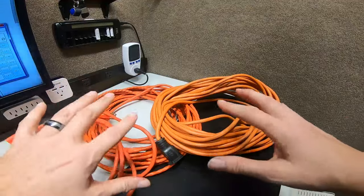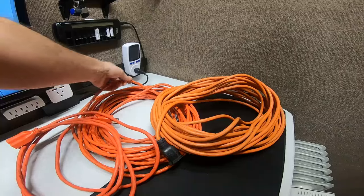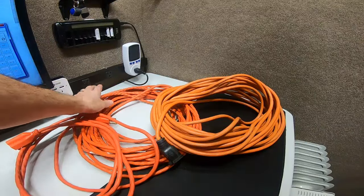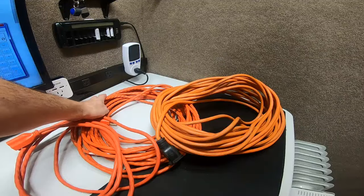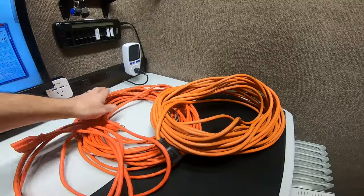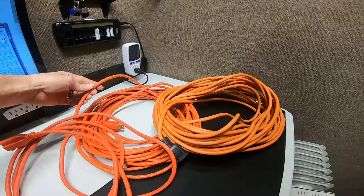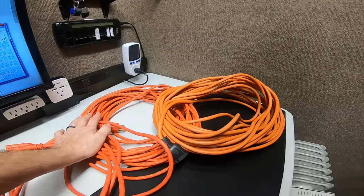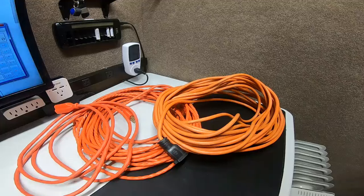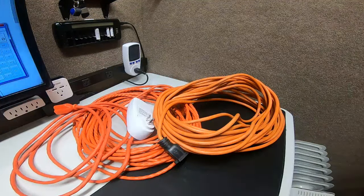You're losing power and don't even understand where. Real quick — if you see a cable that's twisted like this, it means it was either overused with very hot, high amps in very cold temperatures causing it to shrink, or it's just cheap. This one is getting ready for the junkyard, but I thought I'd make a video with these before I get rid of them.